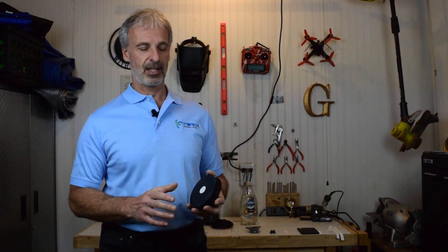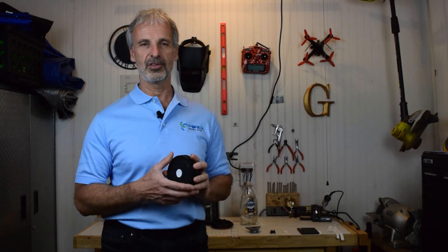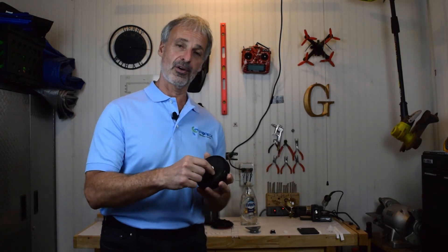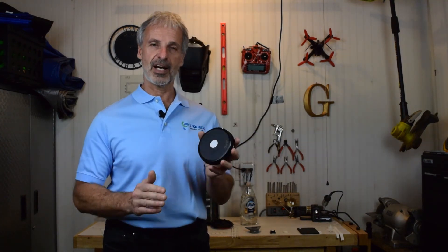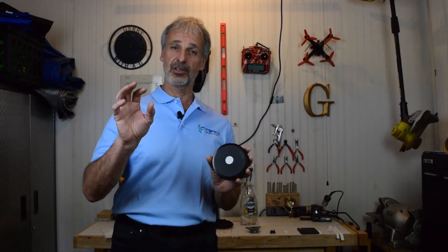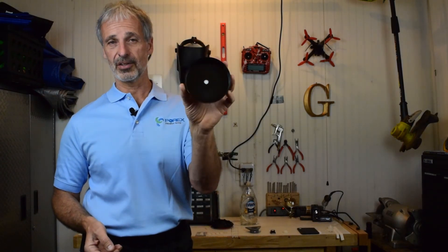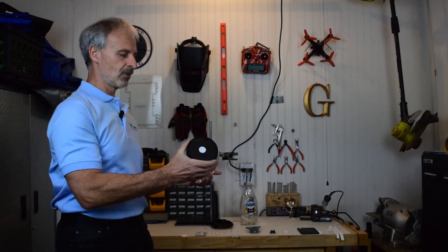The last technique is using a glue or epoxy to affix your disc onto your part. You start off with your part, place or drill a hole into it — it could be molded in place. Then an adhesive or epoxy is applied right around the ring of the hole. The PTFE disc is placed on top, and with slight pressure, the epoxy or glue flows into the PTFE around the ring and you have a venting surface on your device. Very common — you can use a high-speed glue applicator for this, and it's widely used in the electronics and medical industries, resulting in a waterproof seal where the product still vents.